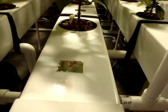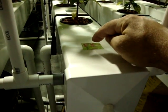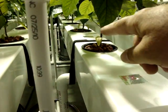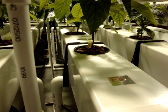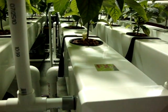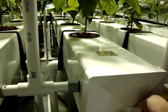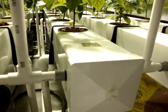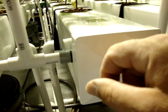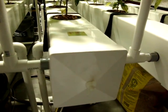Back to the rails - here's the original rail. If you remember from my first video, it's just one single rail with quarter inch tubing that came across with the sprinkler heads down in, and it snaked the quarter inch. What I found was that was good for one rail, but after so many there wasn't enough pressure. So I changed over to threading a half inch solid PVC pipe, putting the heads directly into that and running half inch all the way up, which creates plenty of pressure. All the heads work and run great.